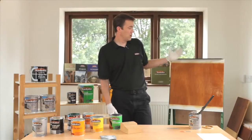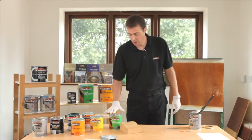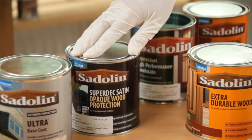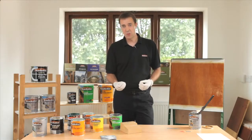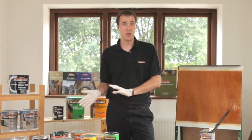Once we've applied and measured the wet film build, it will dry to the recommended dry film build. As long as we put on enough coats as recommended, the system will perform and give us the expected durability. For example, applying Classic with two coats of Extra gives four to five years before a maintenance coat is required. Super Deck potentially gives up to eight years, and Ultra gives up to seven years — provided sufficient product has been applied to the recommended wet film thickness, which dries to the recommended dry film thickness. All that information is on the technical data sheet.